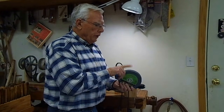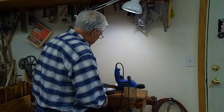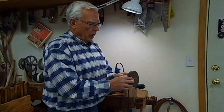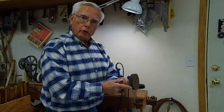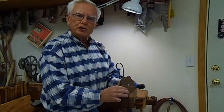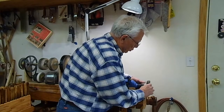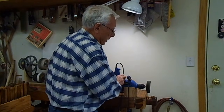I go right from the grinding right to the buffing. For buffing, this is what I used for the first 25 years that I was in business — this is a piece of leather, elephant hide actually, with just a buffing compound on it. That's what I kept all my tools sharp with. You see it doesn't run that straight but it doesn't have to.